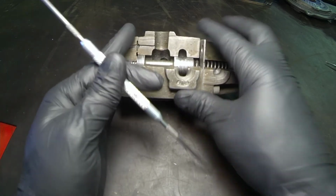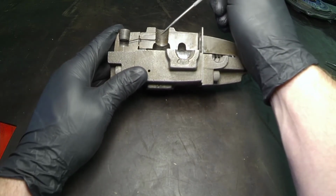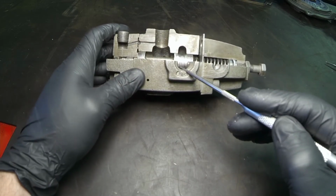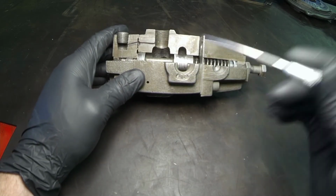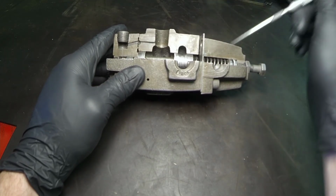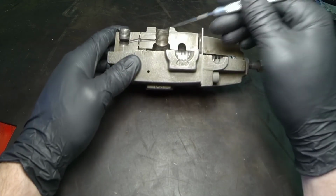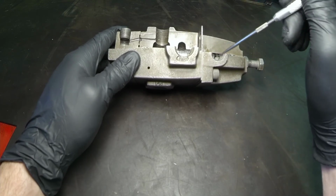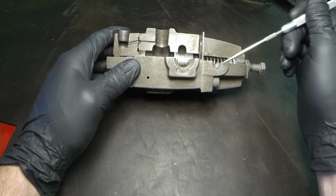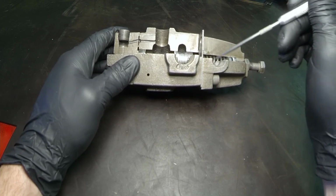Now, a thing to be aware of in our sequence valve here is because we have high pressure oil in this port and eventually in this port, we don't actually have any low pressure ports. And so one thing we need, because this spool will see some leakage, we'll know that leakage will come up into this spring cavity right here. And because we don't have a low pressure port in the main part of the body, we actually need to provide it right here. You can see this little passage right there. We actually need to provide it an external drain. And so this line right here needs to be connected back to tank as an external drain.